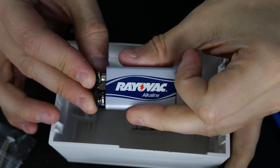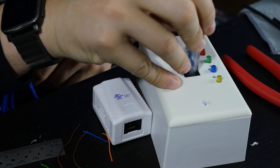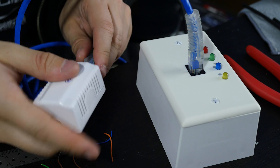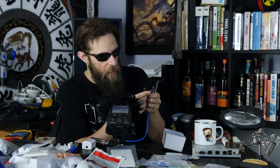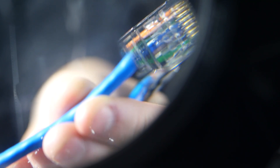Get a 9-volt battery connected to our snap connector, then take a known-good cable — one that's already working — to make sure all the electronics are working properly inside our tester. Plug it in and if all works well it should light up. Something's wrong with this one — it is the cable. I intentionally made this one wrong; I even snipped off the blue wire to show what it looks like when the connection is wrong.